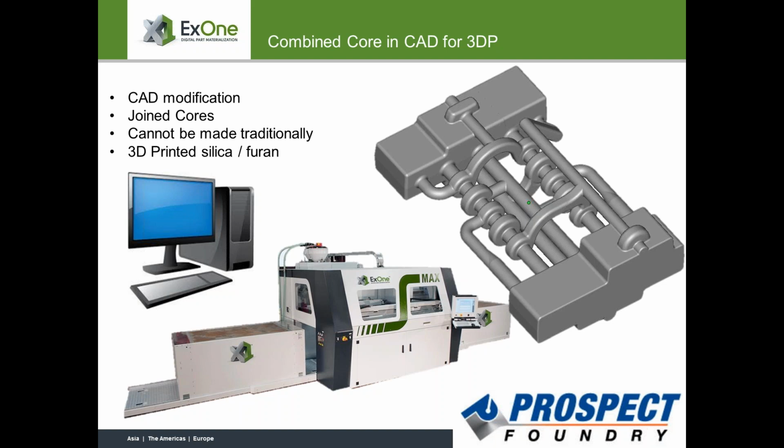Well, our foundry engineer had to put together the model for the core, and basically what he did was he got the model that they used for the shell boxes, and he combined those. He got the core prints off of those, and then he stripped away the metal part of the casting and came up with the inside passageways, and he combined them together and made the actual core model. The model that you currently see on the computer screen. Yeah, that's that model right there. And I had that sent from the foundry to ExOne, and they said, "Yeah, we can make this for you." And they started on the samples. I think we sampled 4 different types of resin and sand, and we finally arrived at the best solution with the help of the team at ExOne.